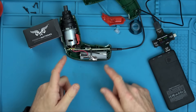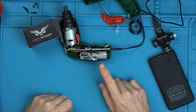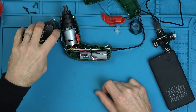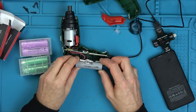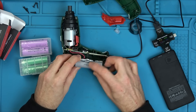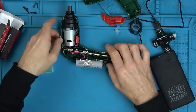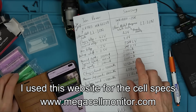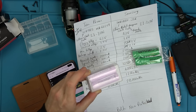So what my question is — if somebody had this, just a normal person who doesn't try to fix things — they're just going to plug this in, go off to work for the day, come back and it's going to be charged, none the wiser that the battery was completely flat. So is it safe or not? If this was mine, I would just leave it charge up and use it. But I know the comments section are going to tell me off because they'll say the battery is unsafe. So there we have it — a failed battery. Or is it something on the board that caused it — a constant little drain that over time pulls the battery way below its safe cutoff point? So once I get a new cell installed, I can do a current test to see whether there's something draining on the board.